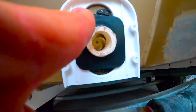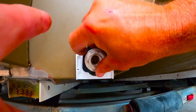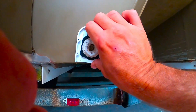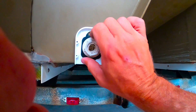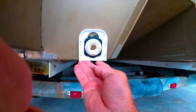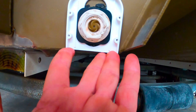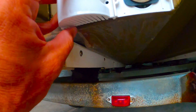This is hard to do with only two hands — I need a camera guy if anybody wants a job, just kidding. Get that nut snugged up. That black washer has a little groove in it for this to sit in, so you can get it exactly how it needs to be before you tighten that nut down. We want it right about flush with the bottom of this hole, because when this piece sits out it's actually going to be sitting back — that's what catches the water.